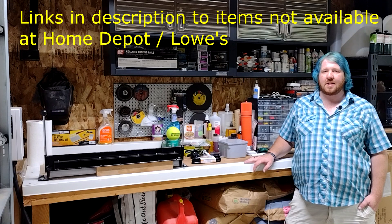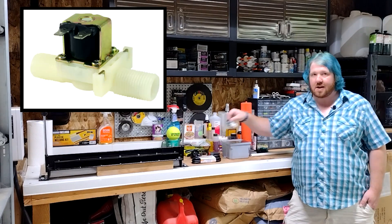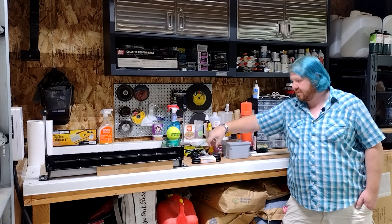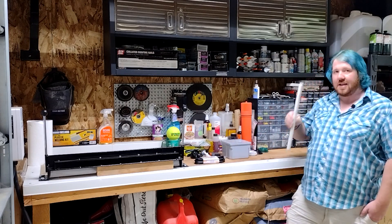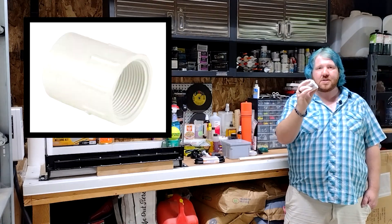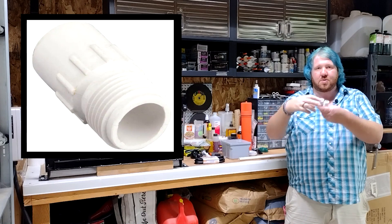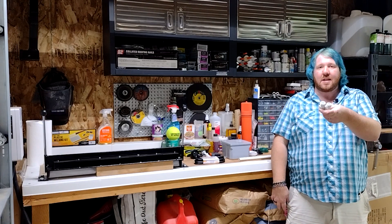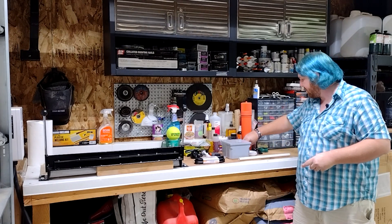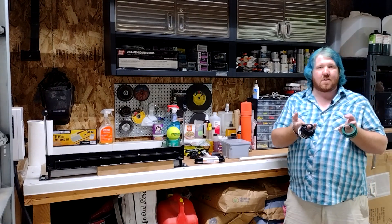The materials you're going to need are: some type of weatherproof outdoor enclosure, a 120-volt solenoid valve, a temperature controller, an extension cord, a scrap piece of half-inch PVC pipe, two slip-to-female PVC couplers, two slip-to-hose-thread PVC adapters — either male or female, however you want to hook yours up (I'm using two male connectors) — a cord connector, and wire of enough different colors to keep everything separate.